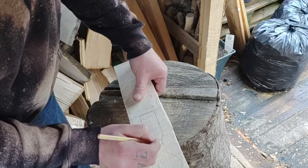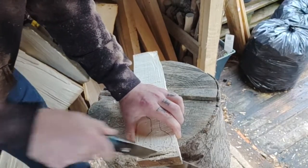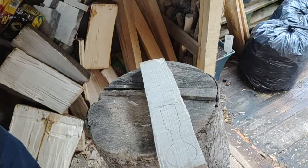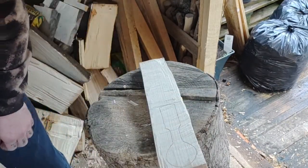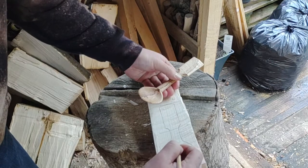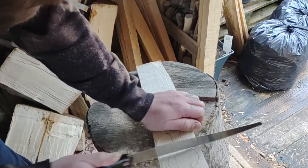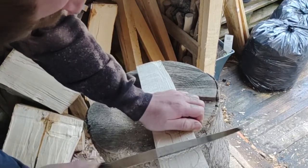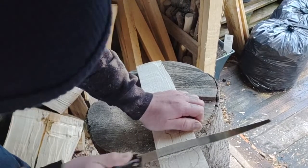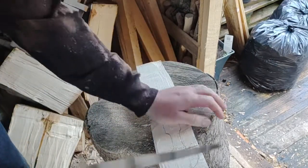What I like to do is have a slight tilt in the bowl — a bit of a crank. I'll cut across at the bowl, about there — you'll see the reason for this in a second. Put a pencil line there so I can see where to put my saw. Start on the back corner near the pencil line, make sure it's square across the bowl, lower the back of the saw so we get a nice square cut. You don't have to go down very far — you don't want to go too far and end up with short grain where the bowl sweeps too steeply.